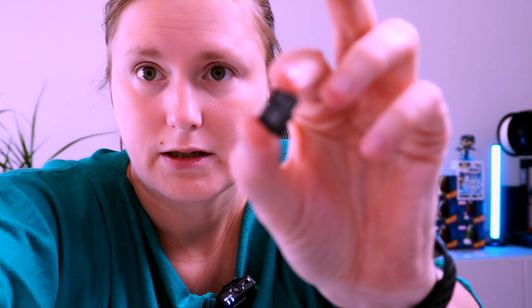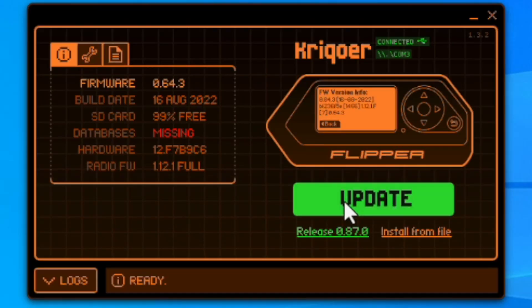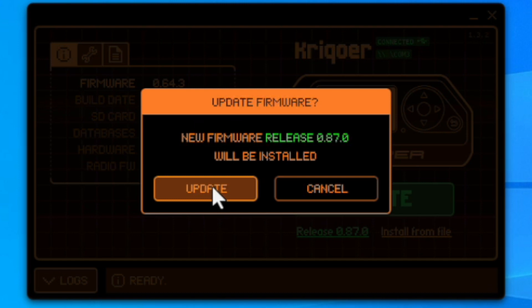I forgot to mention — you'll also want a microSD card. I'm using a 32 GB Sony microSD card. It needs to be formatted with FAT32 or exFAT format, and you insert it into the device with pins facing upwards. The SD card can be anywhere from 4 GB up to 256 GB. It should ideally be something reliable, because as you start playing with Flipper Zero and installing custom firmware and applications, it needs memory to store databases, keys, cards, remotes, and so on.